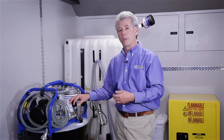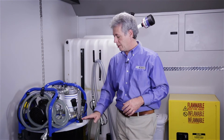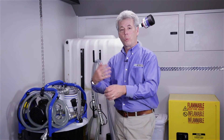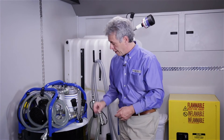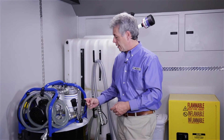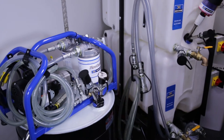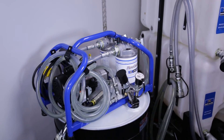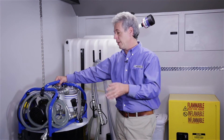We know the national average is that new oil is about eight times too dirty, so we want to filter it and turn it over anywhere between six to ten times. I always like to use ten because the math is easy — so if this is 55 gallons, we want to pump 550 gallons through these filters. By pulling from the bottom — this tube actually goes to the bottom — we run it through the filter system and put it back into the top, making sure it has enough time to cycle ten times.